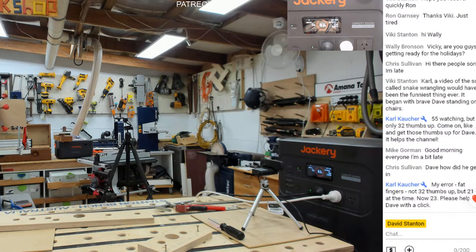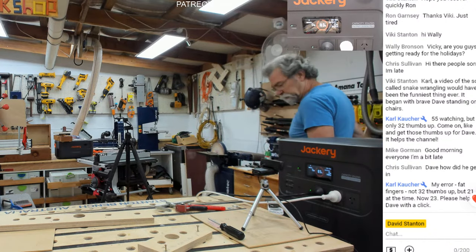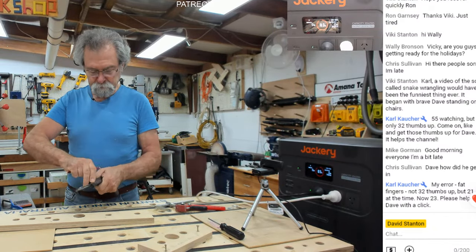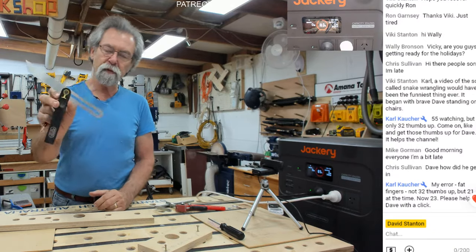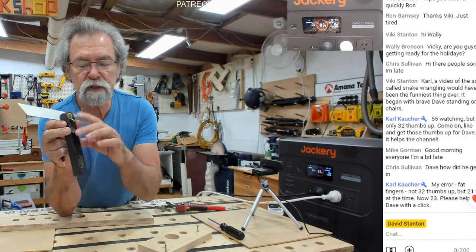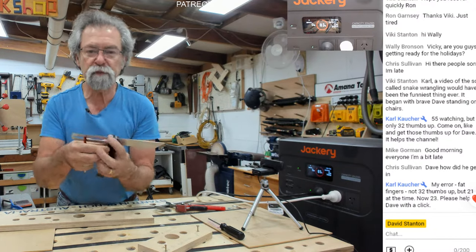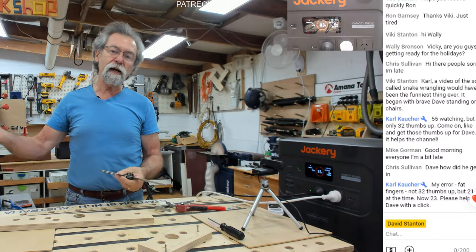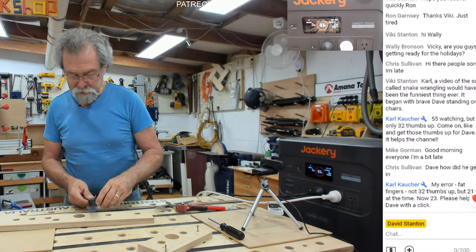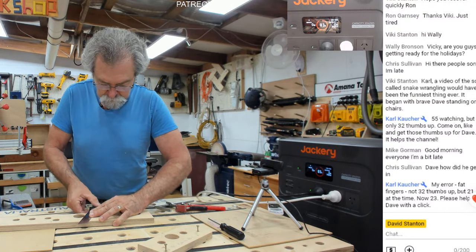All right, so this is a sliding bevel for those that don't know. And for those that do know, that's great. Good, I'm happy for you. Now this bevel is a Veritas bevel. This is fine for joinery, but on a work site, not so good. The reason being, this clamp isn't super tight. You can tighten it up a little bit, but even when you clamp it, I prefer the one that's got the real hard one at the end. Because if I'm marking out rafters every time, I'm dropping it on the ground and it will hold its form. This one is a little bit more delicate, may I say. I think if I do something about there, I think that'll be lovely.